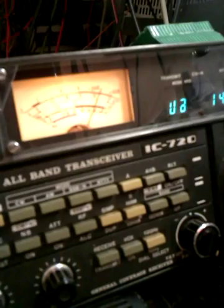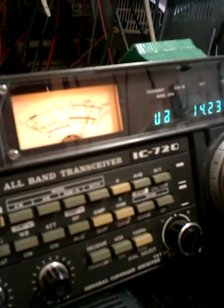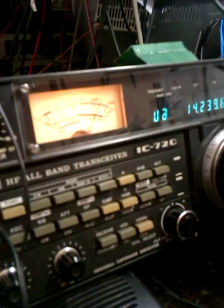After the crystal filter comes another high-frequency amplifier with a transistor, then a product detector again using SR640 from old military equipment. After that is a Panasonic ALC controller used in radio cassette players, giving large audio gain. Then a power audio stage TDA1056 taken from old TV equipment, with AGC using LM358 and some additional transistors. That covers the receiver section.